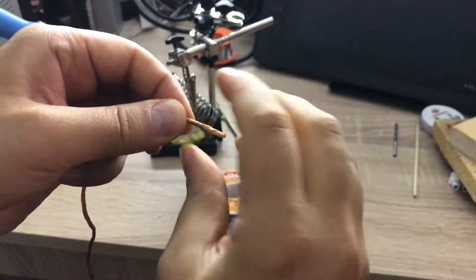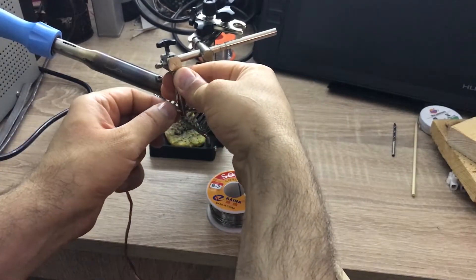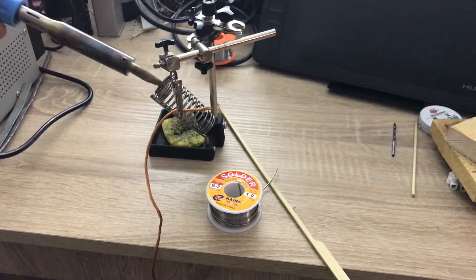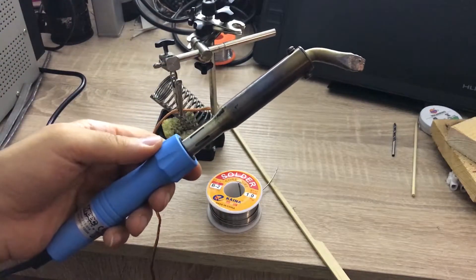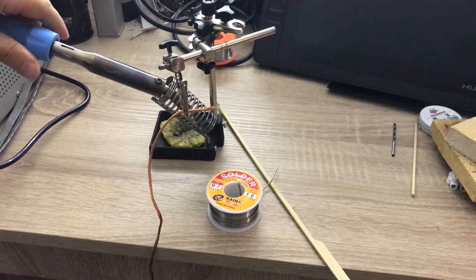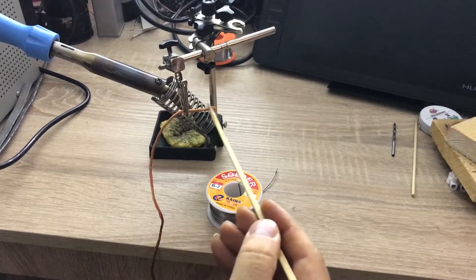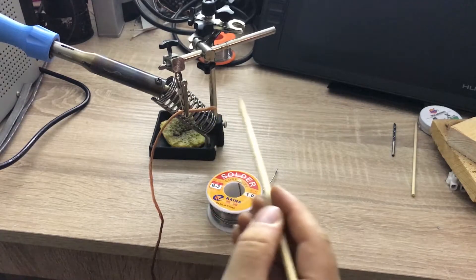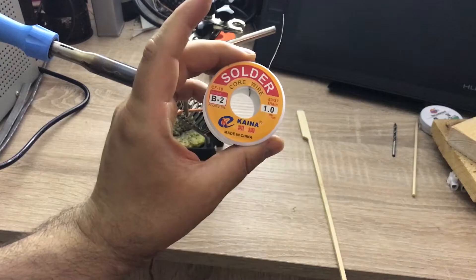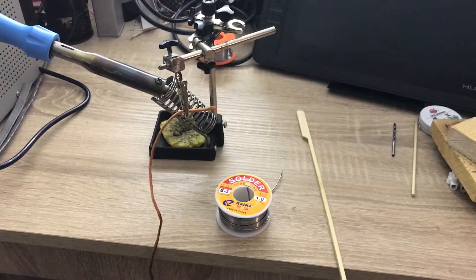It's really difficult to solder this, but with this method it's really easy to do it. Hold your litz wire like this. You need a powerful soldering iron — my soldering iron is 100 watts. You may also need a piece of wood, because while you are soldering there will be burned insulation on it that you want to clean off. I use normal solder wire.